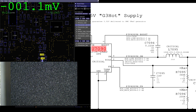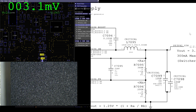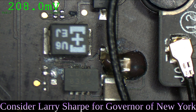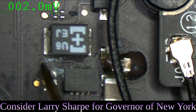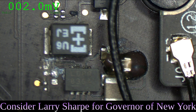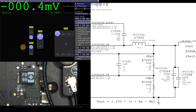It's going to do the switching at the coil and capacitors to ground right here, and then you're going to get PP3V42. So let's see if we get PP3V42. On L7095, we get nothing — 208 millivolts. Where I'm supposed to have a resistor, it seems it's gone. That's R7080.